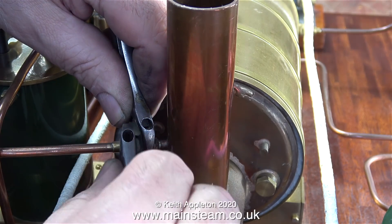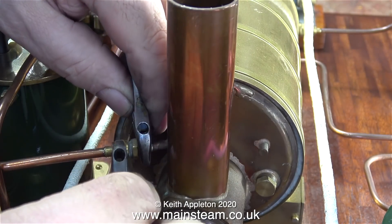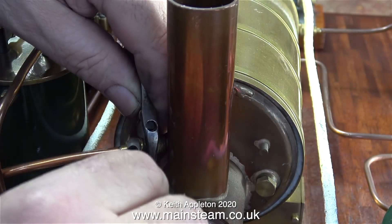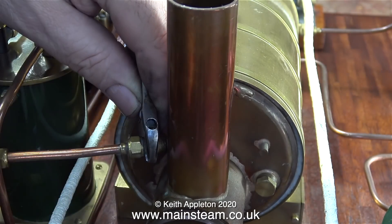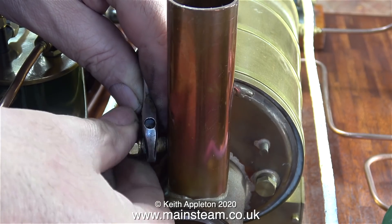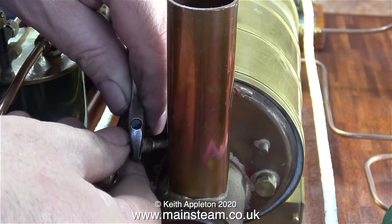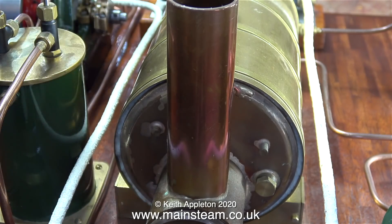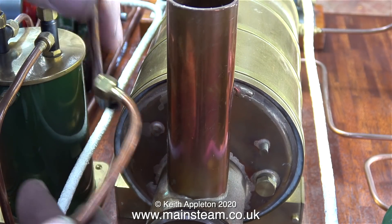This is really not a good thing for a gas-fired boiler. If the exhaust pipe is short and at the bottom of the chimney, when the engine is running at high speed, the blast of the exhaust coming up the chimney is likely to suck the flame off the ceramic burner — I've seen this many times. Exhaust blast pipes and blowers are essential for coal-fired boilers, but not required for gas-fired boilers. Although in some circumstances a very mild, controllable steam blower blowing a jet of steam up the chimney can help with complete combustion of the gas, which is often a problem in centre-flue boilers.